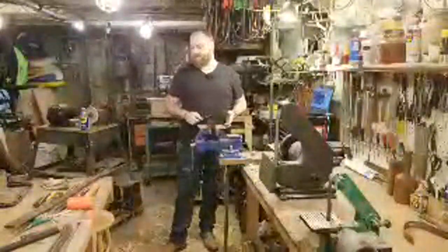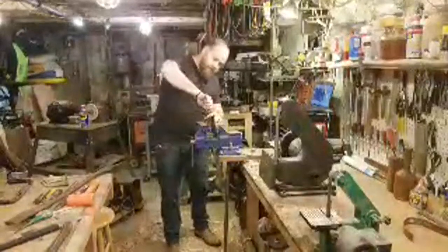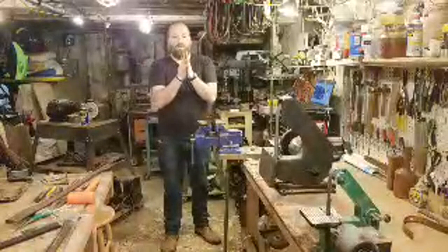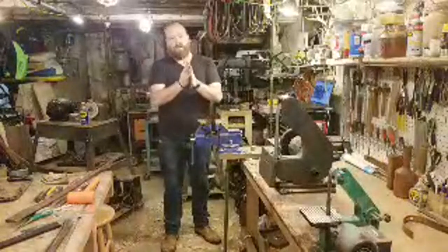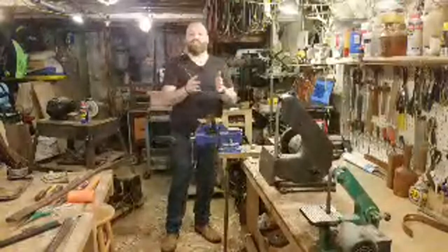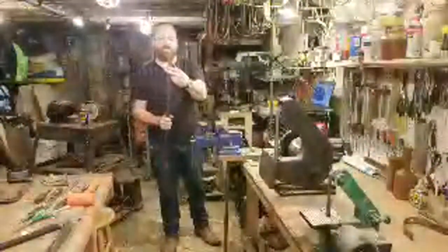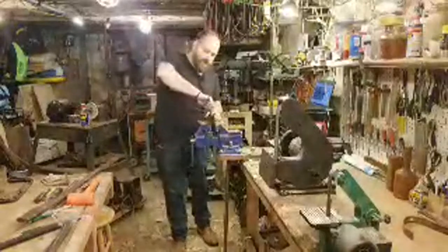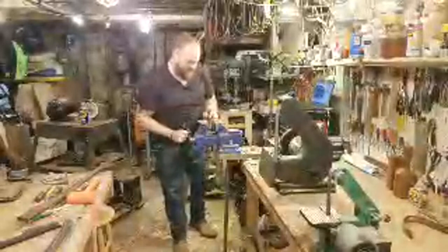When I'm making an axe handle from scratch, I don't cut the kerf first. The reason is that when you cut the kerf, then as you're fitting the axe head onto the handle, it's compressing that kerf. So later, when you put the head on and you want to put your wedge in, your kerf is super tight and smashed together because you've been fitting it through. Now, you obviously can work around that. You can leave some material on the side of the axe handle so that it stays open. But if you can fit it before you cut the kerf, in my experience, it's worked pretty well to get it to fit nice and tight in there, and then cut your kerf. Then you have a nice thin kerf, which is not smashed all the way closed. So that would be my advice.